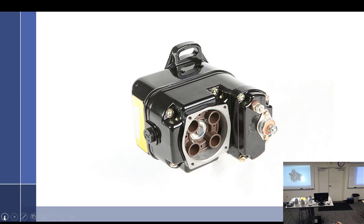All right. These are condensers sticking out the side. They don't belong there. They belong in the cap, but it's just a good place to store them. So one magneto runs both sides. Dual mag. So it's got one rotor and everything else is the same. I mean, wow. One rotor, one drive, everything else has two. Two caps, two distributors, two coils, two sets of points, two everything else, which is fine. So if you had one coil fail, well, you'll lose half of it. So it works great until you lose a drive shaft. Then you lose everything.